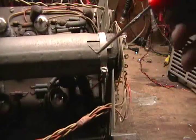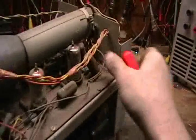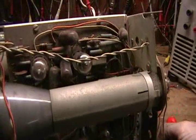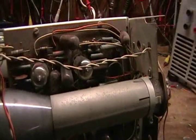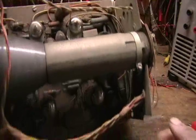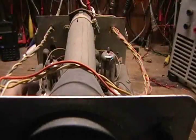For the mounting of the CRT, the neck on it is pretty much a standard mounting system used on a lot of them. It uses standard film capacitors and wire-wound resistors inside, and on this one they've all seemed to pretty much survive the years without any problems, which is surprising considering its age.